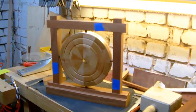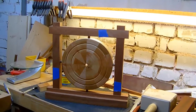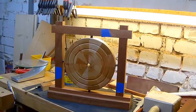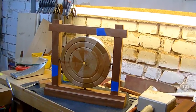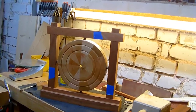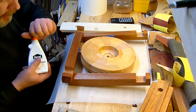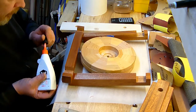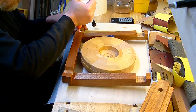Well, this first dry fit looks perfect, and that's the way I hope to get this piece done. So now it's time for the sanding and filling the holes with wood filler, and then the assembly, and the piece is finished. Lots of boring hours later, filled up with sanding, filling holes and gaps, more sanding, applying sanding sealer, and even more sanding, it's time for the assembly.